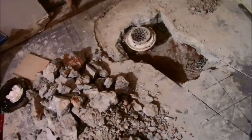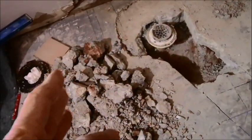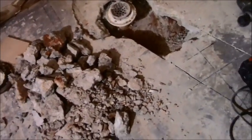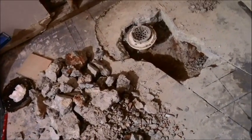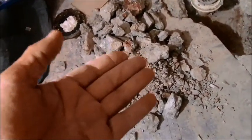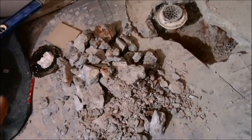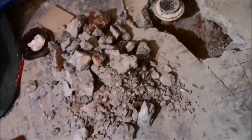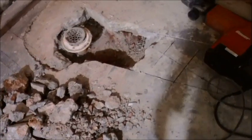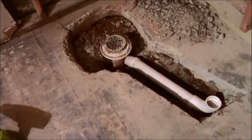But if you're in a condo type situation, you might have what's called a tension wire. They have tension wires that are built into the concrete, and they're attached to either side of the foundation. And do not cut into a tension wire. That would be a very, very bad day. So that's why I prefaced the video by saying that a lot of DIYers, homeowners, will not tackle something like this. Ignorance is not bliss when it comes to semi-major renovation.